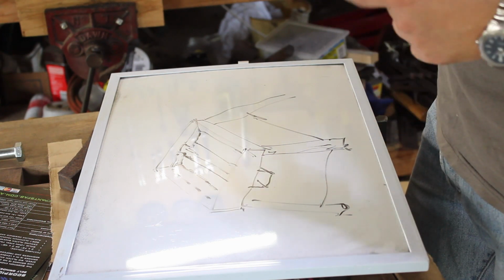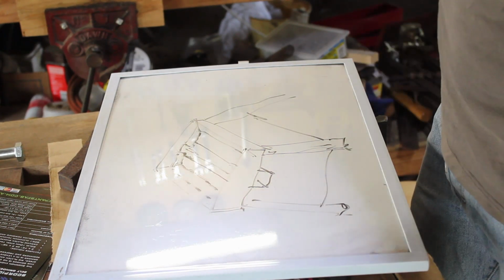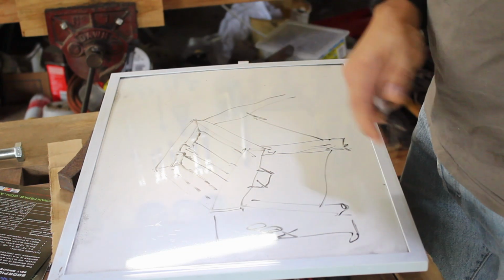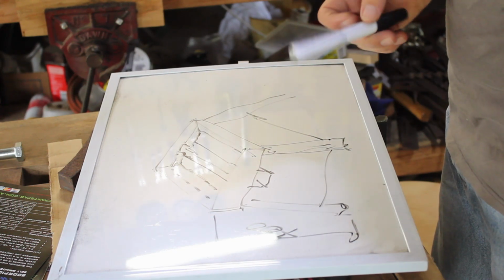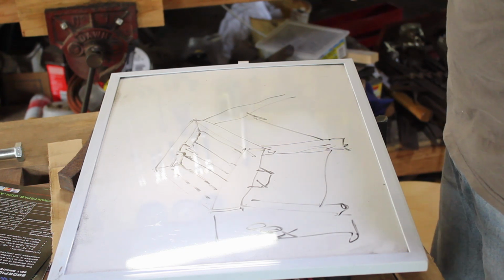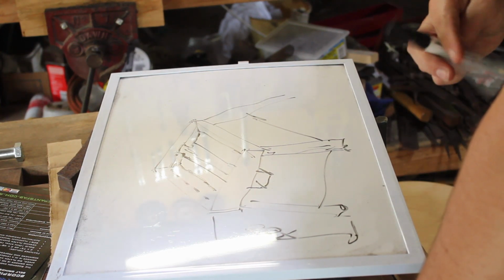And it will be probably aiming for no higher than knee high, so about 400mm overall height. The angle iron is 50 by 50 by 6. The channel is 75 by 40. I think it's a bit shallow, but we'll see how we go. Probably drop it down a little bit. I've got some other stock that I can weld to the edge to give a bit more spacing, but I'd like to minimise the number of welds in impact critical areas.